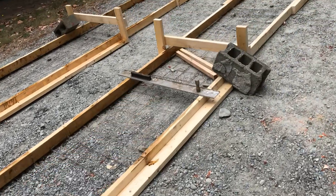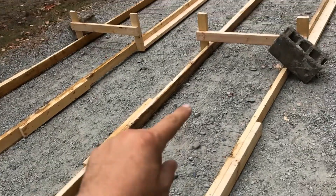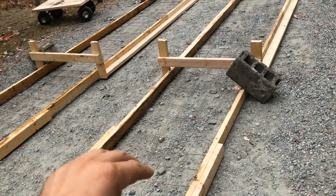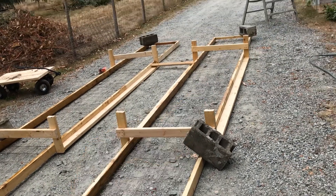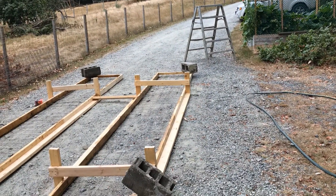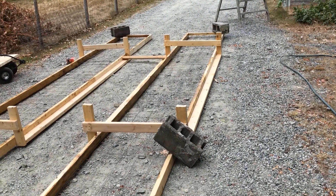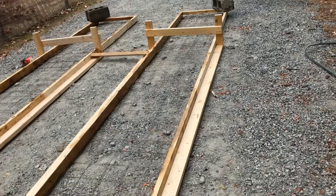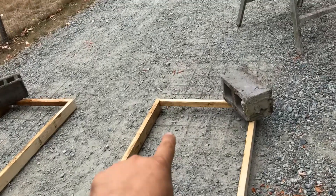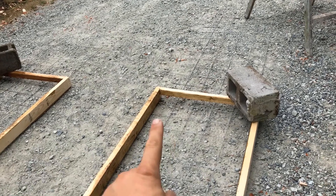We didn't actually stake these forms down — we're just going to weigh them down. This ground has been packed and rollered and pounded down with a roller truck so many times it's extremely hard underneath. There was no landscaping needed; there's so much rock in the soil and riprap. This driveway was done properly and it's very, very hard, so we're going right over it. We're also extending our mesh through.